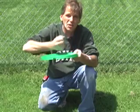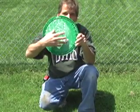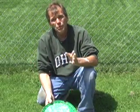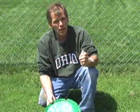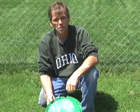to seal it all up at the end of the day, if you haven't cleaned this lid and all these grooves out, all this stuff is also going to drop into your bucket. If you do this little simple procedure, I guarantee you that when it comes time to be wiping your mud off at the end of that project, you're not going to be coming up with these little scratch lines and all this stuff that's going to cause you headaches later.